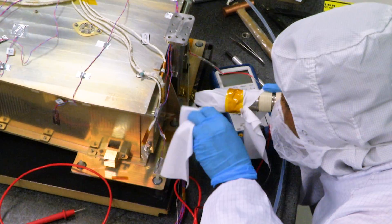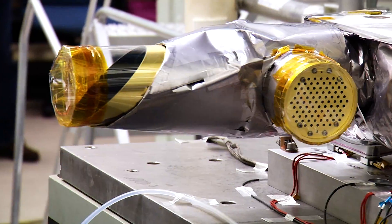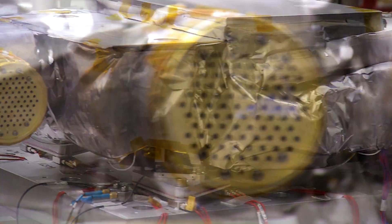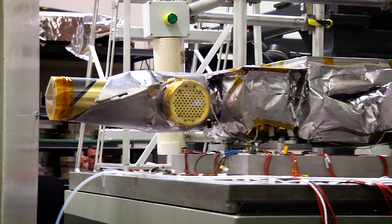On OVIRS, we actually had a case where the glue came a bit apart during thermal testing, and when we put it on the vibration chamber, a full assembly gave way and there was a big pulse on the instrument. We had to stop and go back and make sure that everything was fine, which it was. We also had to redesign things a little bit, and that shows you the value of testing. Had that happened on the launch pad, we wouldn't have been able to do anything about it.